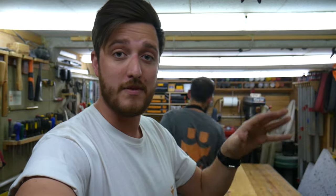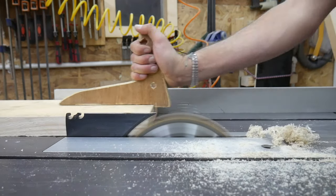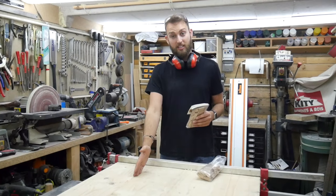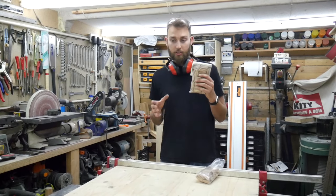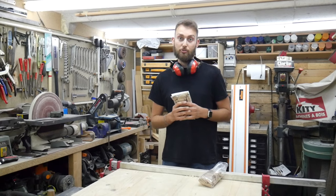The top of the table is made up with four boards so the two centre boards have a joint on both sides. We've taken off one of those sides with the track saw but now we're taking it over to the table saw to make sure they stay parallel. We've cut all those seams and clamped it to see how it looks - the seams are coming together really nicely. To make them a little bit stronger so the glue doesn't have to do all the work, we're going to put some dowels between each of these boards.